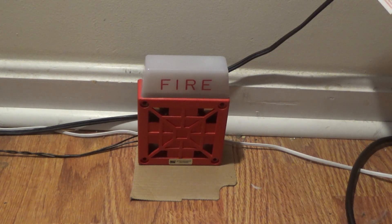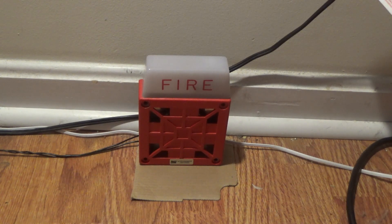It doesn't sound too bad. I'm using my 24-volt filtered DC power supply, so this is not running off of the panel. The dogs are barking upstairs. A 7002T is a pretty awesome alarm, but they're starting to become vintage and rare. Every time you sound the horn and the strobe together, the strobe makes the horn skip a beat — you can hear the famous strobe skipping, which reminds me of my elementary school fire drills. So let's go on to the pull station part of the test.